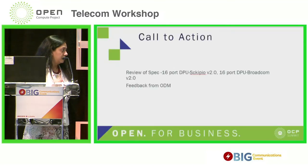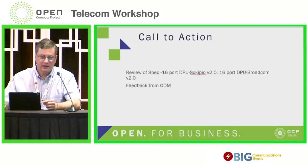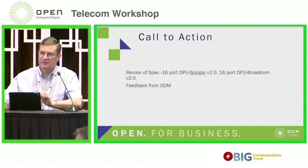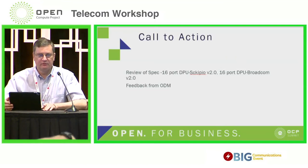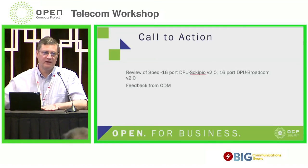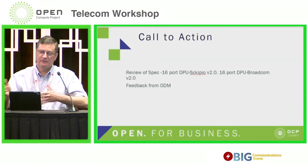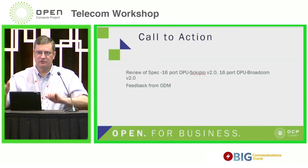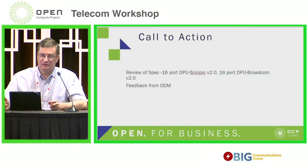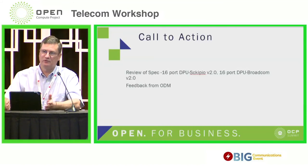I don't know if it's worth bringing up here or not, but one thing I've heard offline on email from other carriers is that after 16 ports, a single port unit was the next most popular thing. You can think of it like a replacement for the original outdoor ONT. You used to go to the side of the house and then worry how you'd get in. Well, now they've got a way to get in, and it was with G.fast. You could use either coax or twisted pair. And in a lot of the European fiber regulatory regimes, each customer gets a fiber, but a lot of them don't want you to drill through their 700-year-old dwelling. That was the story I heard for why they think a single port unit made sense.